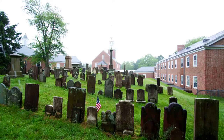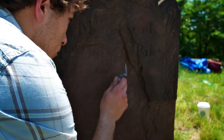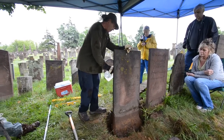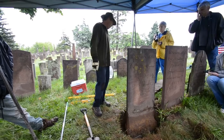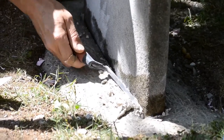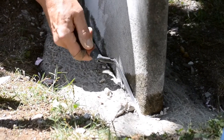A lot of times you're working on things that were previously repaired, and so there are always issues with loss — stone that's missing or highly eroded — Portland cement or other repair materials ranging from Gorilla Glue to liquid nails to caulk, really anything you could find at a hardware store today or a hundred years ago. The overlying principle is to be sensitive to the material and not do things that are destructive or reduce the material — to try to handle them more like you would an archaeological artifact, so as not to diminish them and to preserve as much as possible.